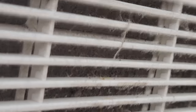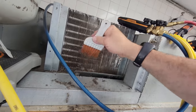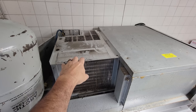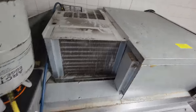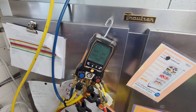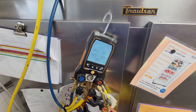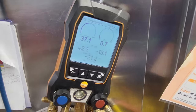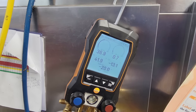As you can see, it may have been a while since they've had anything done to it. Got this thing flipped upside down — that way it'll pull through the coil, which is pretty warm. We went ahead and weighed in the 16 ounces and put it at 83 degrees in there. Now as it gets colder it should drop, which makes me think there's a hellacious leak somewhere.